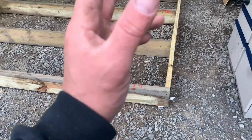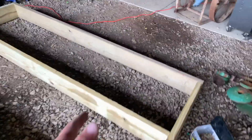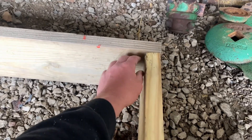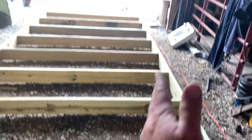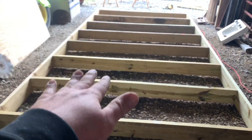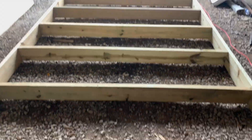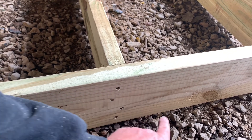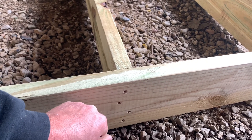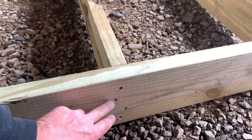We've got all of our floor joists ran, our 2 end joists, and our middle section. I don't have enough 2x8s to double up my ends, so I'm going to use 2x4s, 2x6s, or cut down 2x10s or 12s. We're going to lock it all in and tie all the corners. We're putting 4x4s for skids underneath and the decking on top, so we won't need a bunch of spreaders in here. Notice my screwing pattern: I put one in the middle top, one in the middle bottom, then stagger two on an angle. This ties it from moving left and right, up and down, sideways, and you're not putting all the screws in one joint to split your board over time.